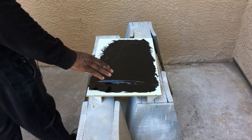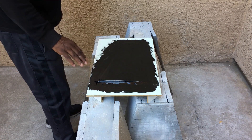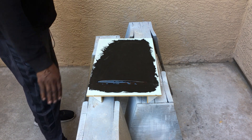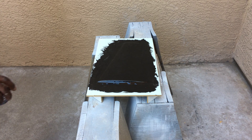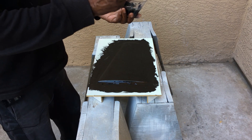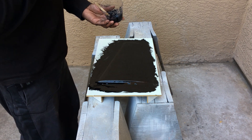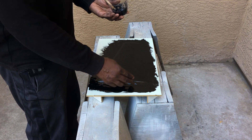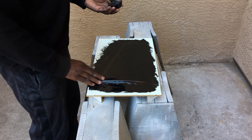This surface coat is now dry, and what I'm going to do now is mix up some more epoxy with cabosil and graphite powder and make it a little thicker this time. I'm going to put it right on here in the corners, and then after that I'm going to start laying fiberglass and resin on top of that. I want this to be thick because these 90-degree bends right here — fiberglass doesn't like 90-degree bends — so this fills that bend so the glass lays nice.